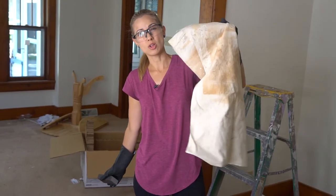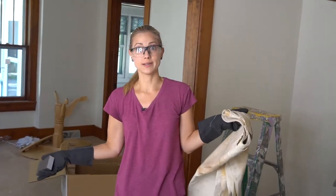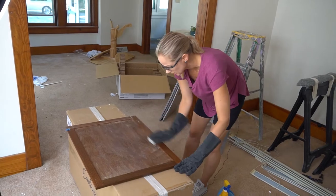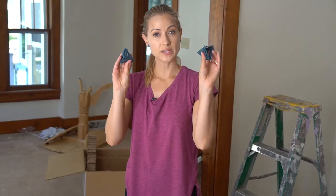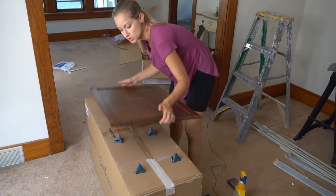By the way, most of you are going to want a drop cloth underneath, but we just have really ugly carpet that we're tearing up, so we don't care if we get paint on it. Now, if you thought exfoliating was just for your face, you were wrong. It's time to take a sanding sponge and exfoliate the cabinets — you're just trying to remove the shine and roughness so the paint sticks. Now remove any excess dust. These are painter tripods. You want to set them on your surface so they elevate the cabinet door so it doesn't smudge when you're painting. Start with the back of the cabinet facing up, so when you're done, you flip it. If the tripod leaves a mark, nobody cares — it'll be classy in the front, party in the back, aka the mullet technique.